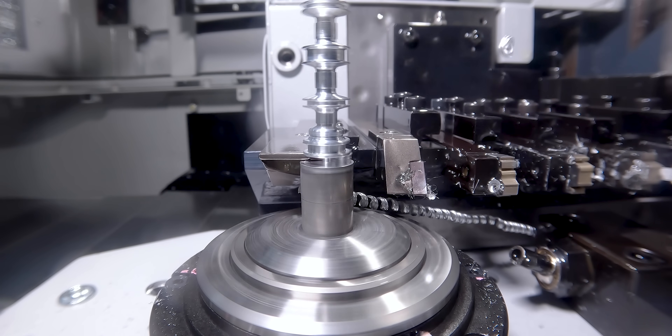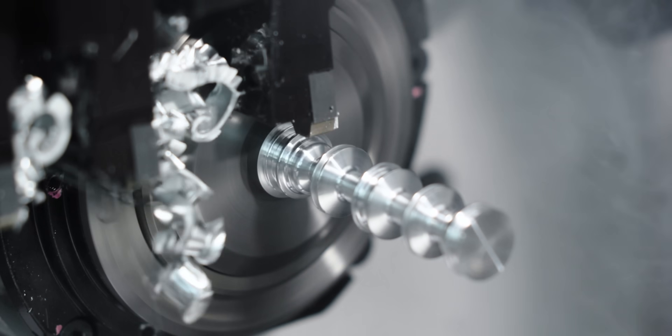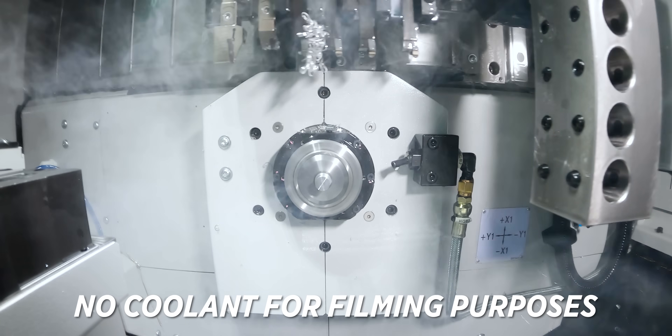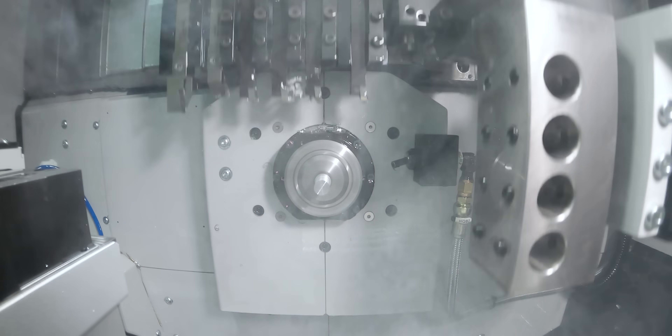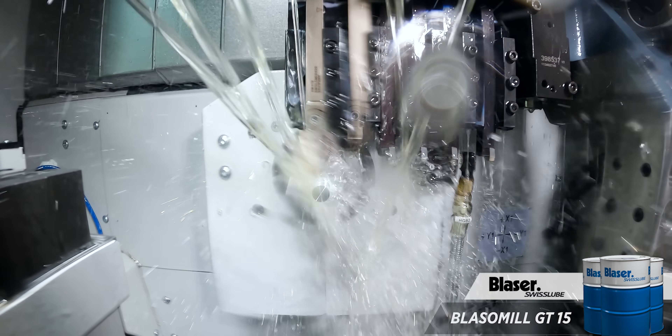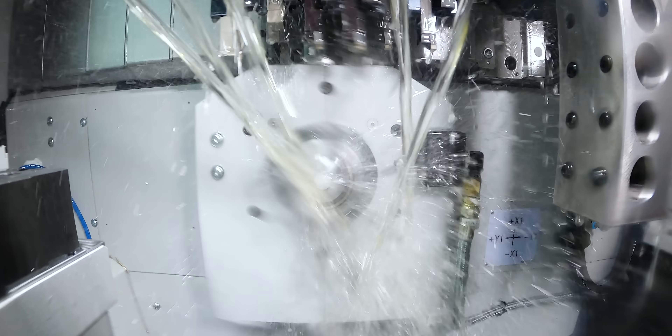You might notice when watching these tools cut that you hear a ch-ch-ch-ch as they're cutting — that's because I'm using Tornos' ACB technology. While the tool is moving in X, it moves in an oscillation pattern in sync with the spindle to create air pockets in the cut, which is guaranteed to break the chip. Instead of worrying about a big nest building up, I can just use a G-code to break the chip and make life easier. Also worth noting: we ran this dry without coolant so we could show you the machining footage. It's insane how much better the Blaser coolant made the part look — the part looked pretty torn dry, but once run with coolant it came out really shiny. Now let's run our final part with all adjustments made.